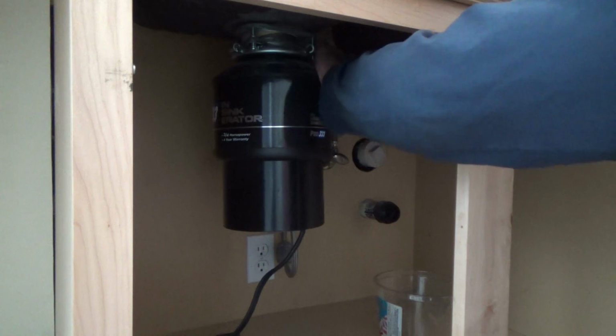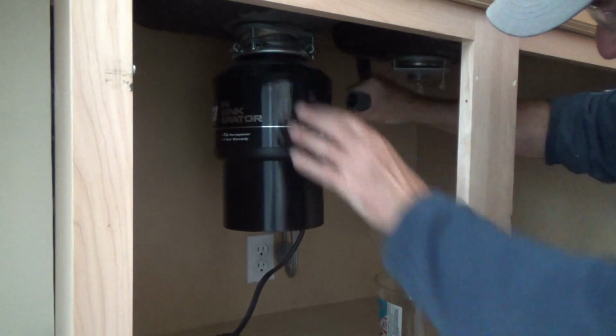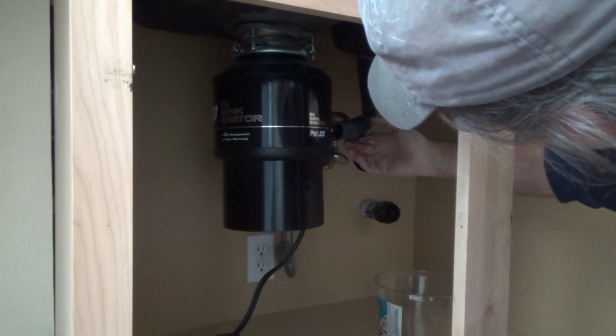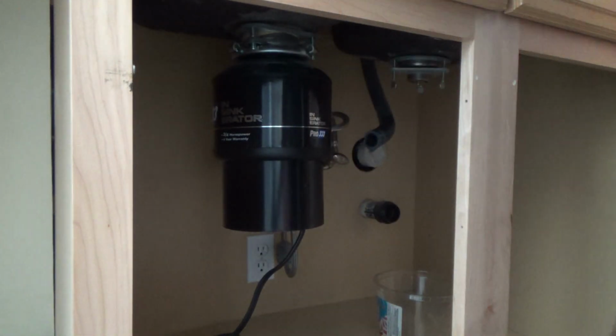Sometimes, not all the time, okay, now I'm just wiggling that to get this off of there. Oh, there, okay? That goes up to the air gap, and I could leave that, like I say, because it's attached to the sink, right? But when you get garbage disposals, okay, here, that piece is up. Can you see that? It sticks out right there, that nib. I think you can. Right there. That's where that pipe goes, see? Right in there. Okay? When you get new garbage disposals, there's a knockout in there.